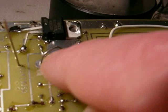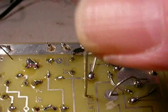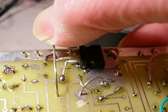You're going to solder the negative of the filter without shorting it to the center here. Solder the negative to the pad here and then solder here for more rigidity. The positive wire is going to go over to the regulator — put a piece of heat shrink tubing on it — to the input of the regulator.